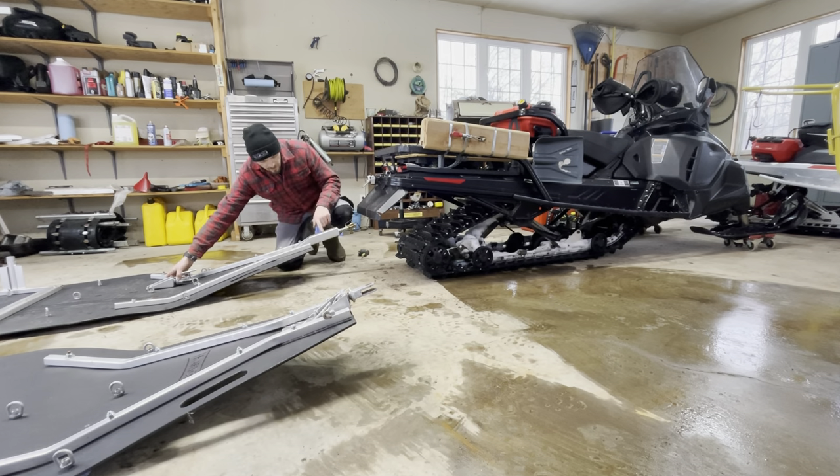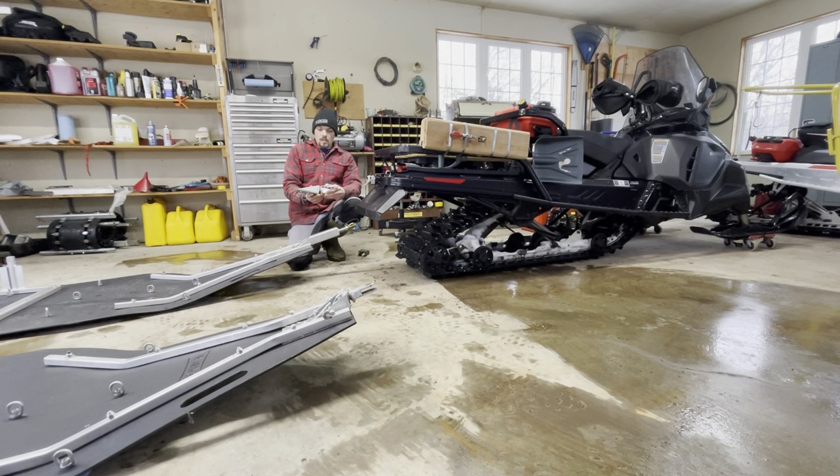I gave a fresh coat on the factory hitch, and I still have it — it can sit underneath the passenger seat with me in case I have an issue. I'll carry three-eighths hardware with me, and I have a spare hitch if there's a failure, because you're dead in the water otherwise. With this you can tow with a strap, but if you get to a hill it's just going to slide into you.